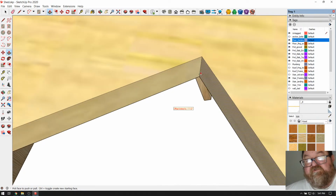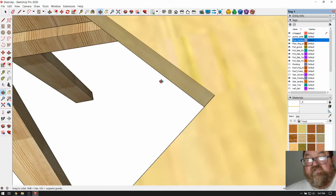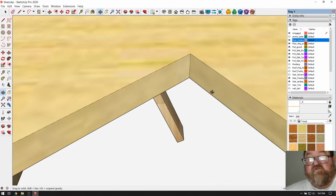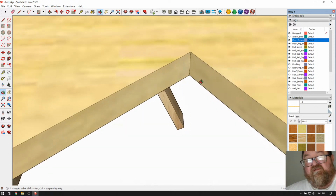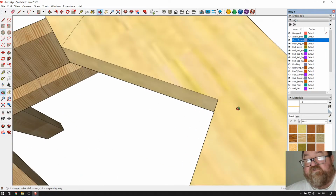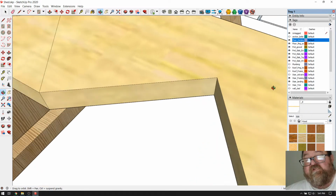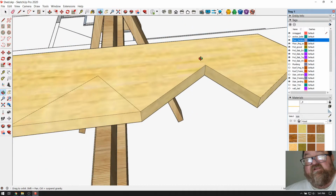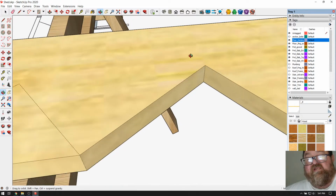What you're going to do is take a handsaw and finish the cut. You're going to have a little radius here that's still left on there, that you haven't cut out. If you cut this like a lot of carpenters do, they'll just run the saw by until that bottom radius of the saw cuts to here. And so what they're doing is weakening it. You're taking this thin part and making it even thinner.